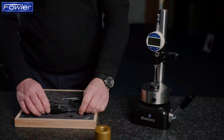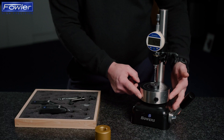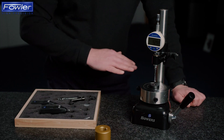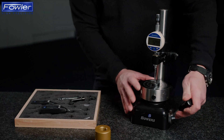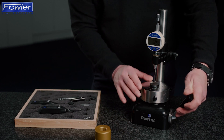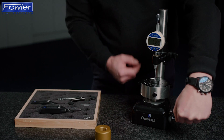For batch inspection of components which lend themselves to a table, we've got a setup here which is the micro gauge comparator stand. What we've got here is a floating table — this table is allowed to float in the horizontal XY plane, and the surface of the table stays perpendicular to the axis of the gauge. What that allows us to do is raise and lower the table maintaining this perpendicularity. If I put a part on there, the table aligns the part and guides the gauge into the bore. There is no skill required — I can take this component off, bring the next one in, and allow the gauge to align itself. We've also got adjustment and stops so the operator comes down to a fixed stop and doesn't crash the probe into the table.